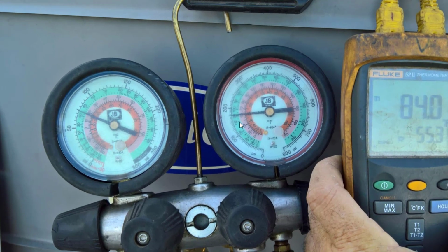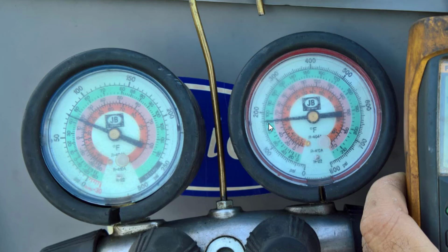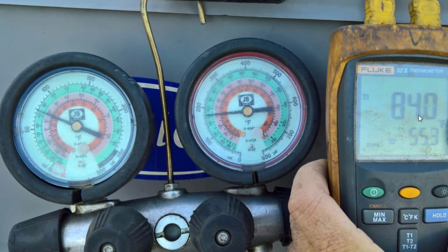Yet when you check the pressures here, there's like 91, 84, so it's like 7, 8 degrees of subcooling, and then here 45, 55, 10 degrees superheat. You think, hey, that's pressures and subcool and superheat. You would think that'd be a normally operating unit, but it wasn't, because somehow one of these accurators, instead of being restricted, was flooding through, and maybe the other one's restricted. I don't know. Somehow a column of liquid, and it looks like it was up here maybe, was going right through one of these circuits and coming right back, not boiled off.